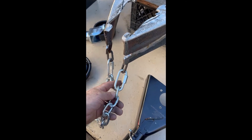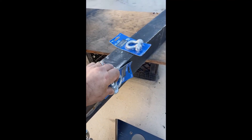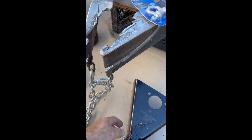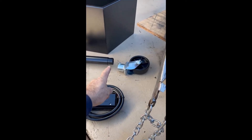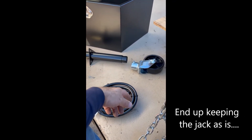I saw this on another build — I'm not going to use it the old way. I'm going to take these and weld them on like that. They'll be welded on, and that way I can unscrew this to change the chain out in the future. This is like four bucks and I'll just weld it on at a nice strong spot — this is just temporary right now. One thing I'm going to have to figure out is the height of this to be able to use the wheel underneath the tongue. I might have to elevate that part or re-weld it at a different height so I can utilize the wheel — I like being able to push it around without having to lift it up.